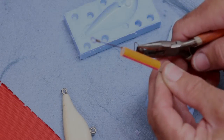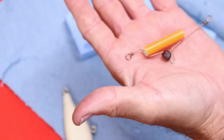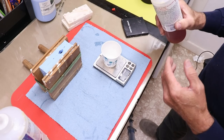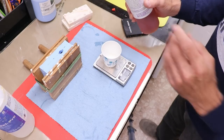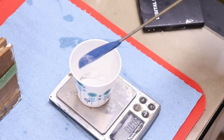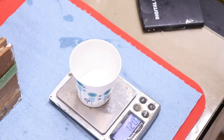Both halves are cleaned up. Now I'm preparing my typical arrangement for an internal wire harness. The counterweight is just a split shot and that tube is a rattle chamber - it fits the mold perfectly. Now let's mix some casting resin. My standard mix is a 10% mix with micro balloons: six grams of part A, six grams of part B, and 1.2 grams of micro balloons. I like to mix the micro balloons into part A before adding part B because you really don't have much time.